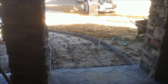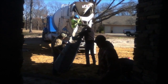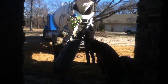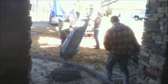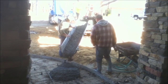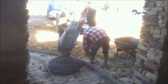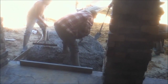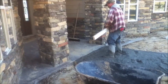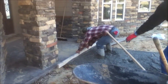It is early in the morning, and the concrete crew is ready to start pouring a stiff mixture of material into the forms and begin the process of preparing the walk for stain and stamps. Here, they make sure to keep the reinforcing steel grid in the center of the mass and distribute the concrete throughout the forms and plane the walkway with the screed.